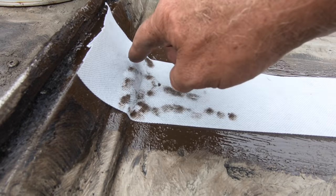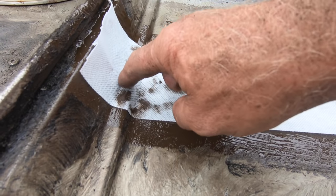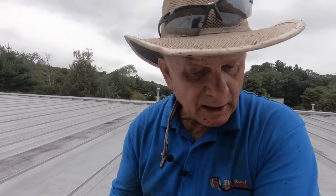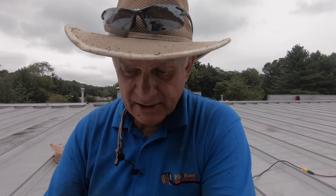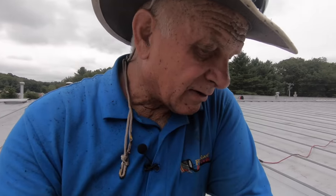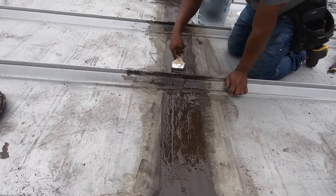Once you go there, it's very simple to do the repair. What's nice about this polyurethane — it stays pliable, it's stretchable after it cures. It doesn't go hard or dry like tar. Tar goes hard and dries and cracks; this does not. It sticks to metal, it sticks to tar or asphalt, and it stays pliable, which is very nice because the two joints do move — they contract and expand — and that's what causes the cracks.